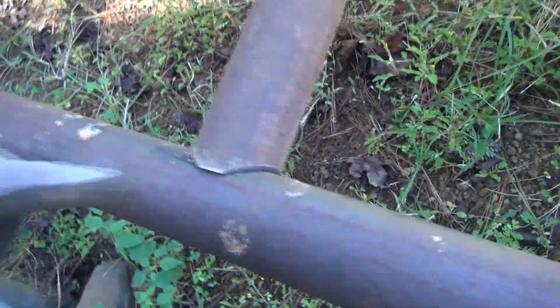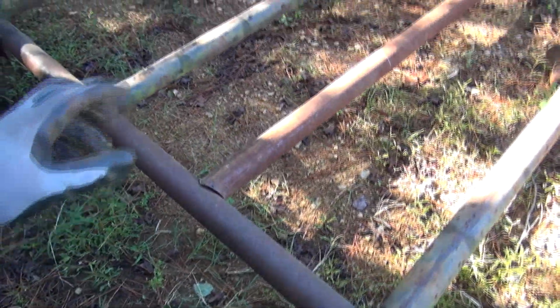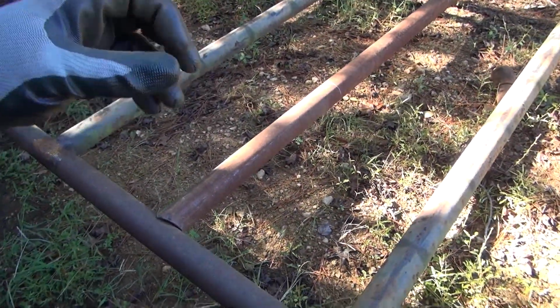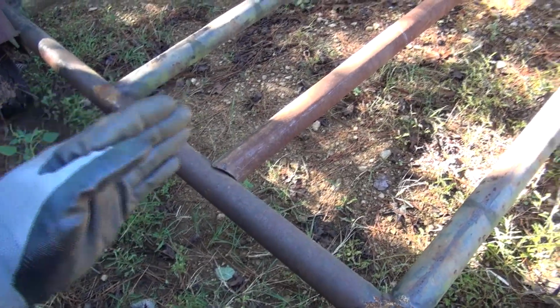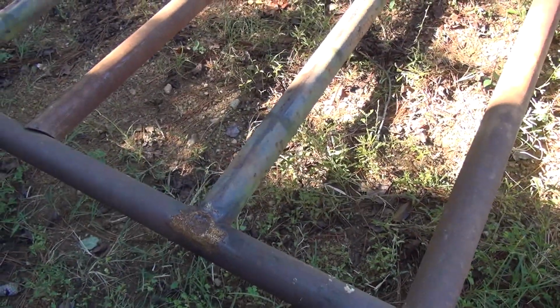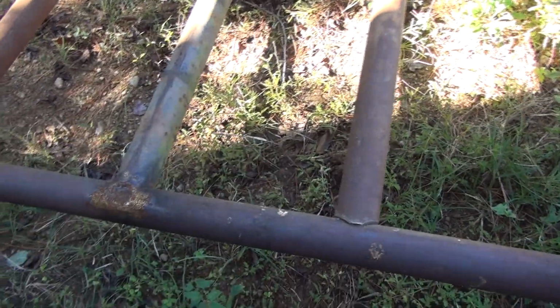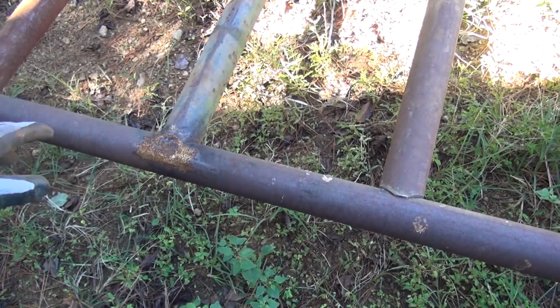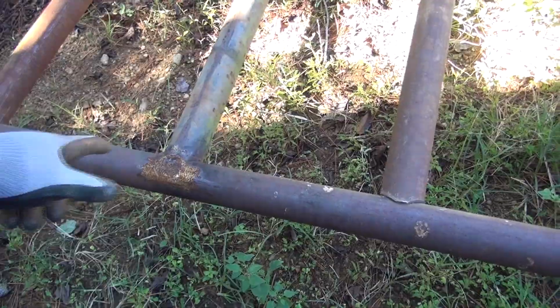And this one here fit good on this end. It's just I got off on the other end down there. And I think using that wider angle iron, marking on the end of it like I did, I may be not perfectly true in line from one end of the pipe to the other. That's part of my issue right there. But it's going to make this trailer a lot stronger doing this, adding these cross members in here. I think my dad built this 30 years ago. I think these are on 36 inches.